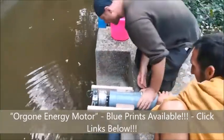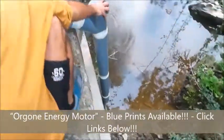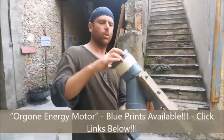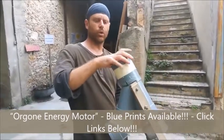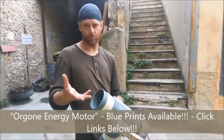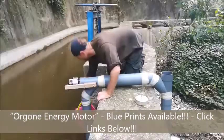So we're going with the unreinforced PCU fan because it did the best revs. The 3D printed impeller did a good job, it did more torque with less revs. I want more revs with less torque. I don't want less torque, but I want more revs because that means more voltage, which means less transmission losses and stuff.